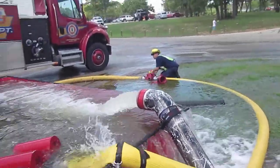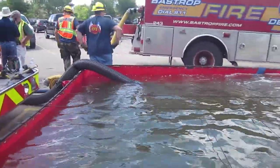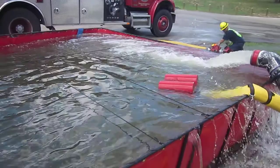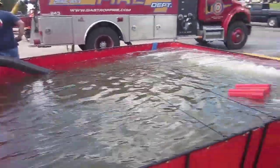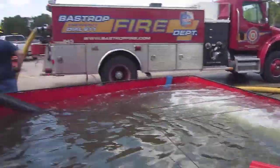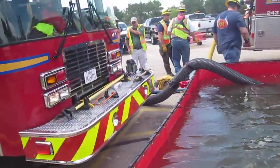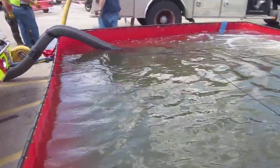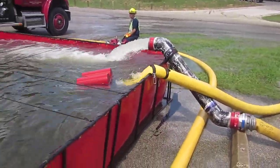And now they're filling the master tender, and we'll watch this for a little bit. We'll try to see what the water level is here as they're filling. So he's running a manifold — they've got the manifold over there, running 5-inch direct fill right in. Their goal is 1,000 gallons a minute, and thus far they've been able to keep up. We already see the tank stop overflowing.